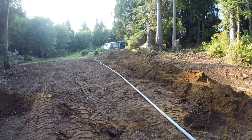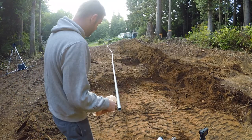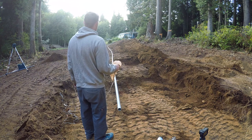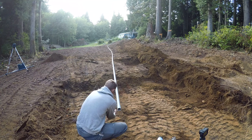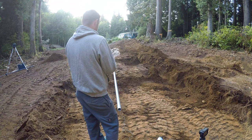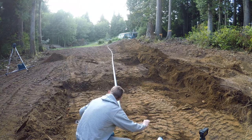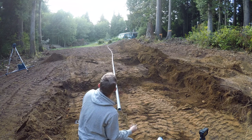I just got to string the wires through it. I have Christy turn the vacuum on and suck this up the tube. All right, turn it on. Okay, turn it off. I'm just tying it as we go. That sure works. It pulls really hard. Okay, turn it back on, and as soon as I raise my hand, turn it off.